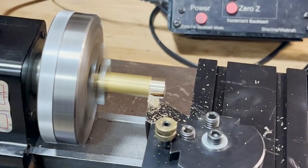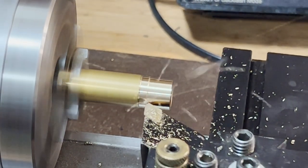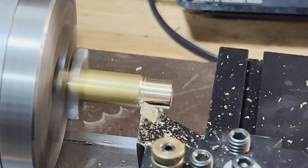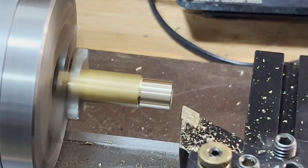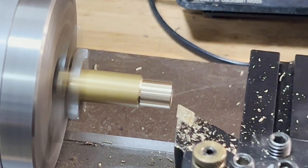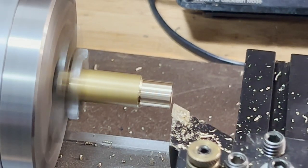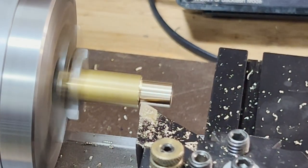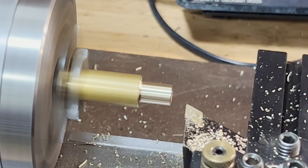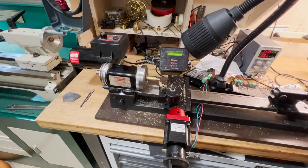This thing worked extremely well. It came out right to tolerance first time. There's a little bit of calibration you need — you've got to calibrate those stepper motors for your application — but Open G-code Sender has all the calibration routines built in. It's a really amazing program that makes it so approachable. For the Arduino, you can buy shields that can drive four axes, but the motors I used are a little large for that shield, so you can just buy those controllers on Amazon. It's surprisingly inexpensive — all in, I'm probably at $150. I really encourage this project; it's going to be a great tool. I hope you enjoyed — please subscribe, and I'll be back making another clock after this.